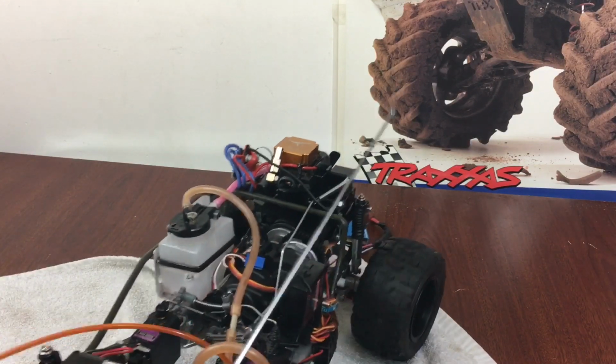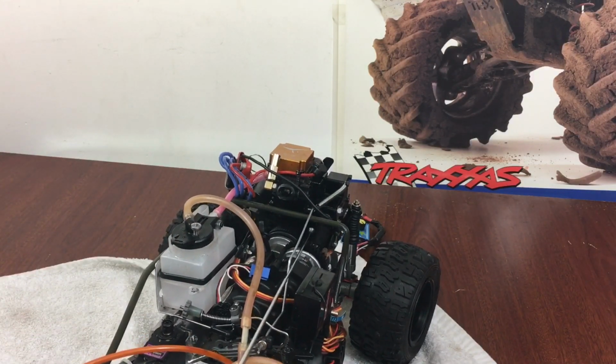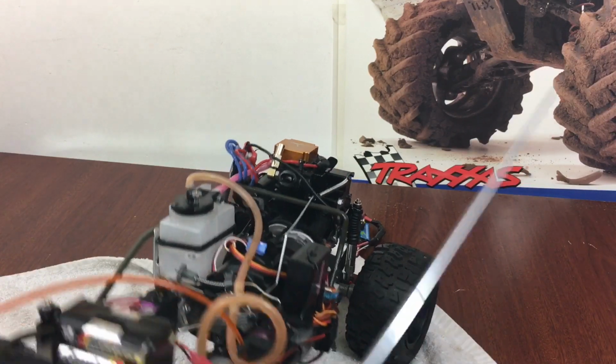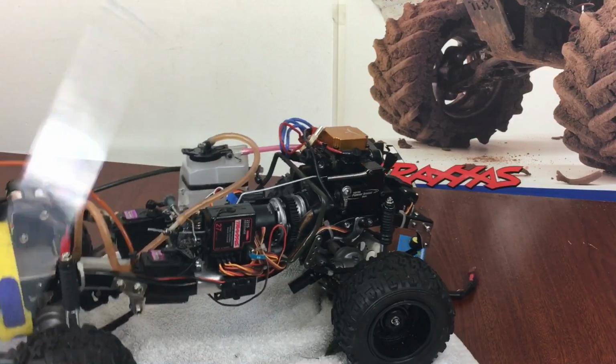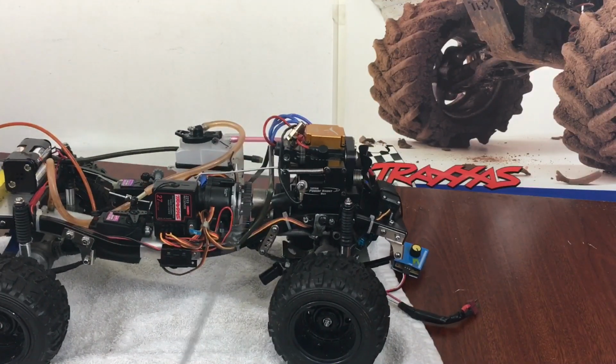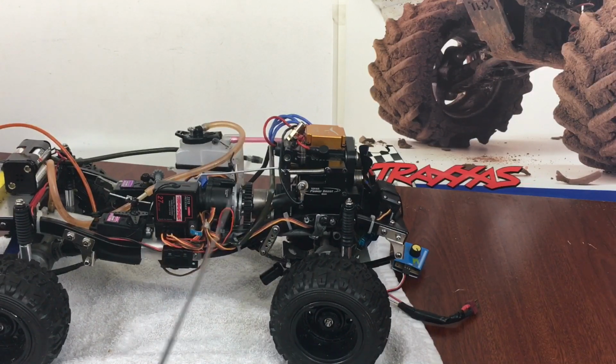So here's what I did. I drilled a hole up top on the back side here, and I moved the nipple up there. Don't do that, whatever you do, because that was a lot of my fuel problem. Because this thing has chambers in it, it comes out here, it's an open box, and it comes into a path down here. And that's where I had my nipple. I thought, oh great, it'll pop right here. It'll give a nice boost of pressure to my fuel tank. But here's what happens. Yeah, it does that.